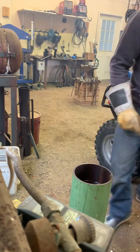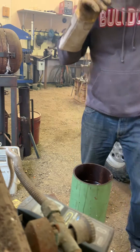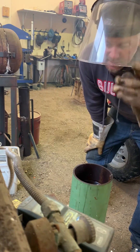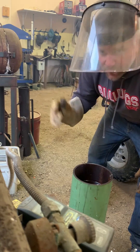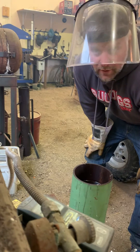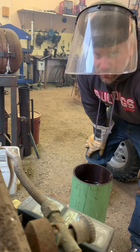Should have safety stuff on. The salt is very explosive if it gets any kind of moisture — water or anything drops into it that it doesn't like, it can explode. We're talking 1500-degree salt flying around the shop. I have it stuck to my ceiling, so I know it can happen. So I do generally put a face mask on when I do this.